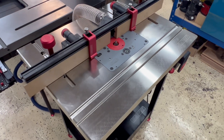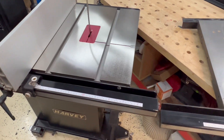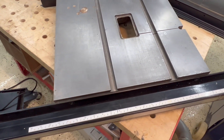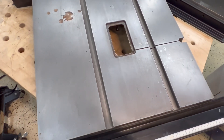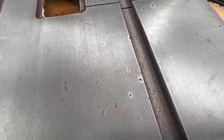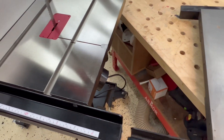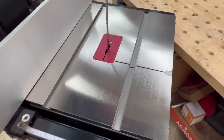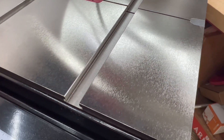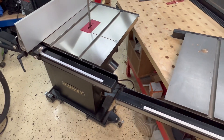Little to zero maintenance on these new nickel coating tops. Of course it's the same for the bandsaw — you'll see a really great comparison here of the new top versus my old top, even some gouges in the top. The new nickel top is also nearly three times harder on the metal hardness scale rating than cast iron, so those gouges likely would not have even happened on the new nickel top. It's this extra toughness that goes back to my original statement of protecting your investment over time.